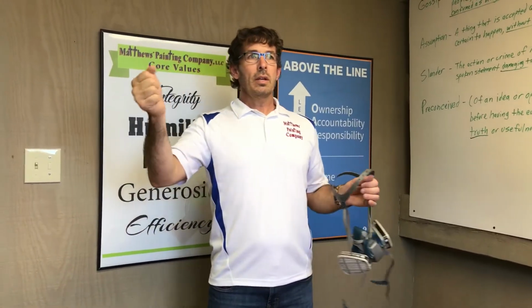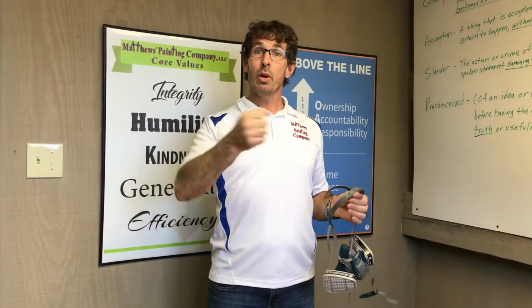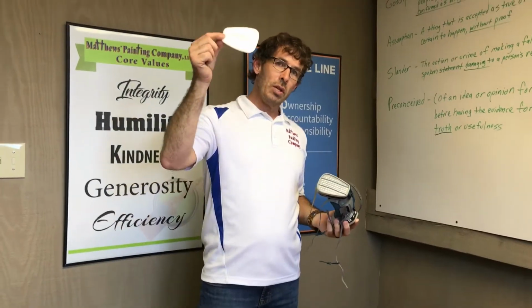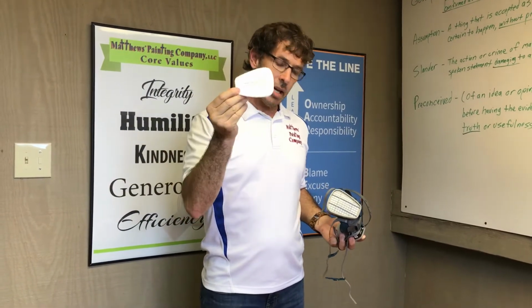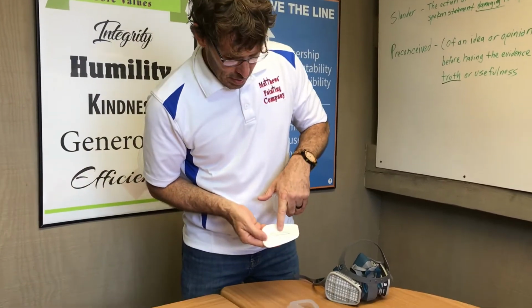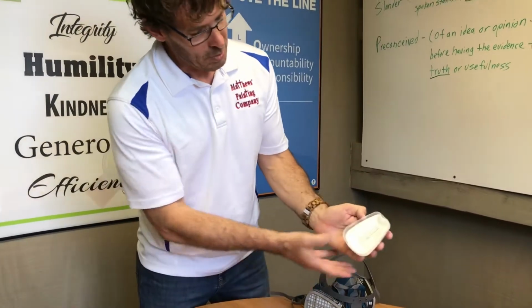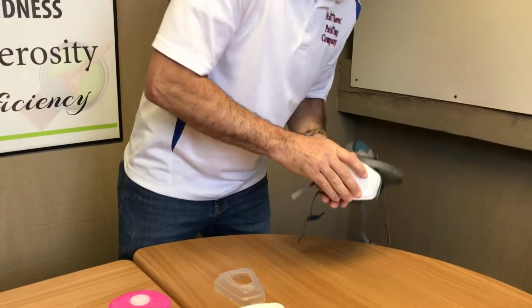If we were using oil-based stains or oil-based paints or oil-based primers and we were spraying them, you could still just wear this like this, but the mist would get in there and get it clogged up. And so in the last video, that's where these little pre-filters are really good for. There's some writing on one side. It says this side goes towards the mask. And so what we do here, we put the side that says toward mask in first. I'm wrong. I'm glad I did that wrong. That's going to be towards the mask. So it says mask side, and then you just snap it into place right over top of that.